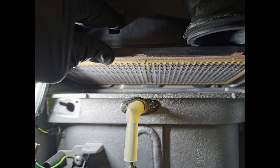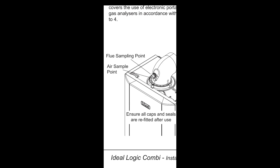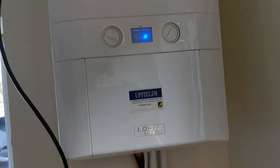Burner back in place — before you screw it back down, just double check that the seal is in one piece. Case back on. Do your analyzer readings — there are two test points on these depending on the age: the right-hand side black test nipple which you can attach a U-gauge to, or the regular cap test point on the flue turret itself.